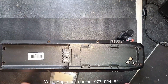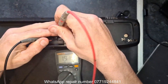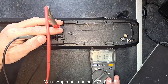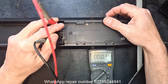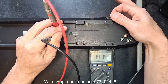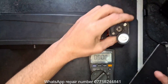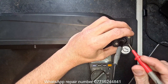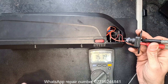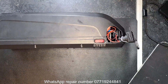Quick test — is there anything at all coming out of this? The light is terrible but I'm reading 1.95 volts. Turning the switch on: 1.915 — regardless of whether the switch is on or off. Checking the charge port: pin 1 positive, pin 2 negative — getting 1.619 volts. Again, not full voltage regardless of the switch. Let's open this up and have a look inside.